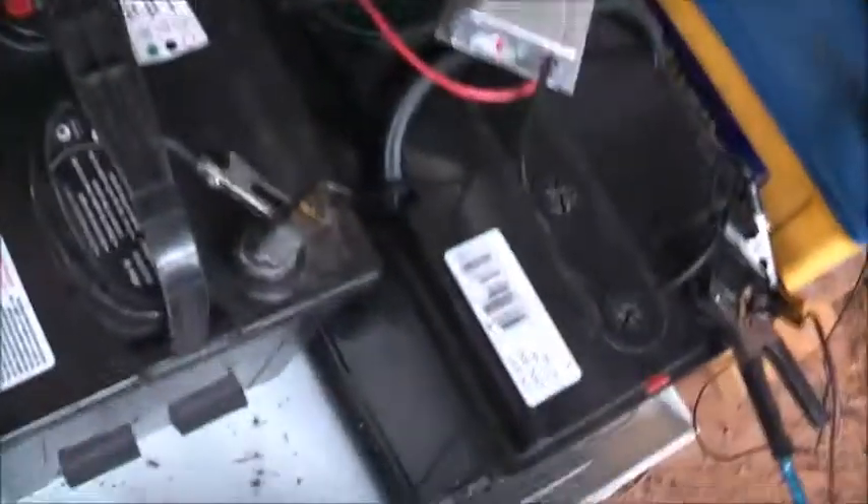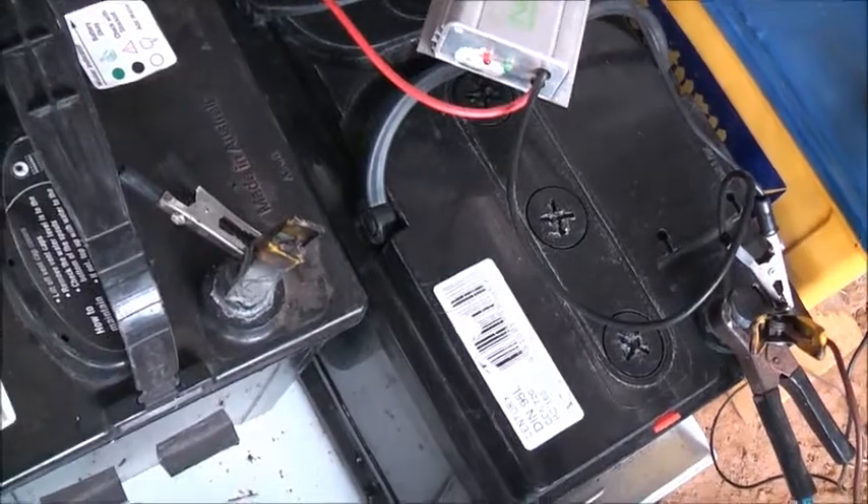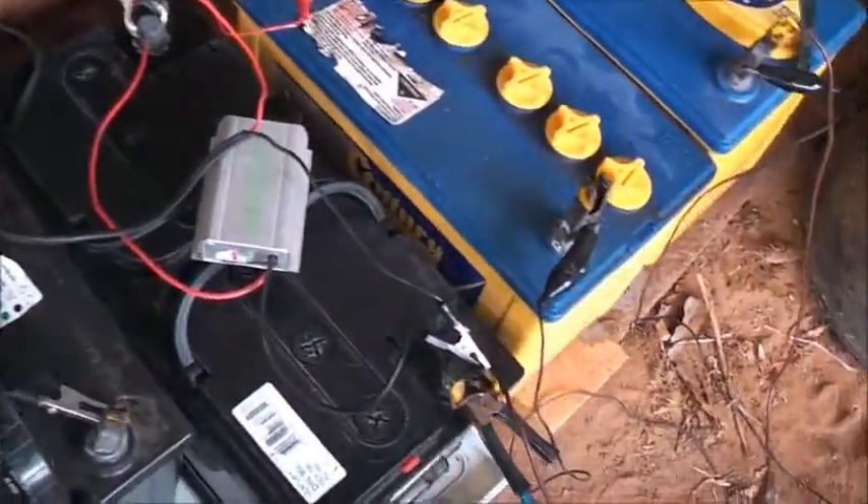Sure enough, this one is revived. This one only charged 8 volts from the 12 volts - I had that jumping across the desulfater onto that other battery pack sitting here overnight. You need a lot more than that - the battery pack's ready for it. I only had 12 volts going into an 18 volt battery pack, so the difference probably would have been the 8 volts or so, that's all it charged to. Anyway, let's see how this other battery goes. I'm going to leave this one on the wall wart all night with 24 volts into it - we'll come back and check it tomorrow.